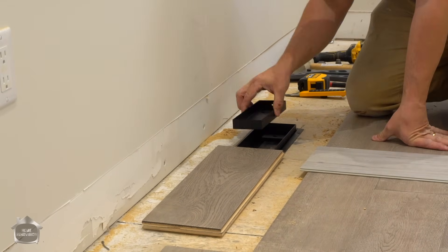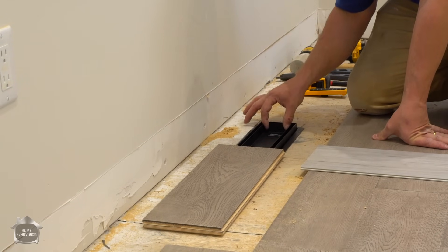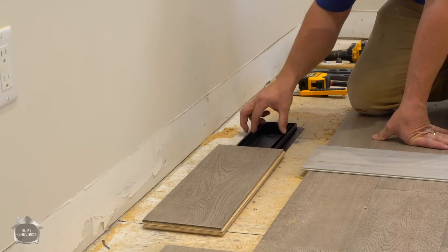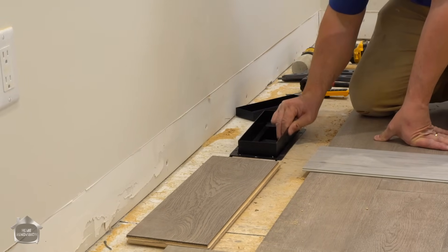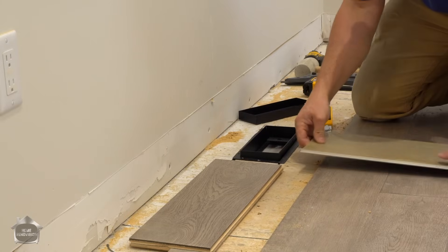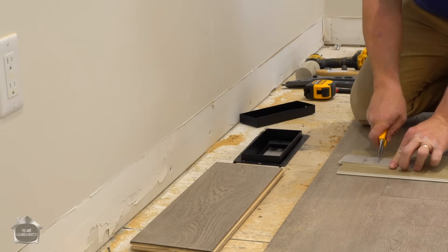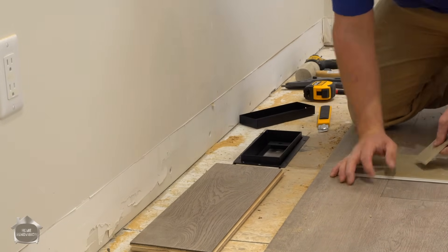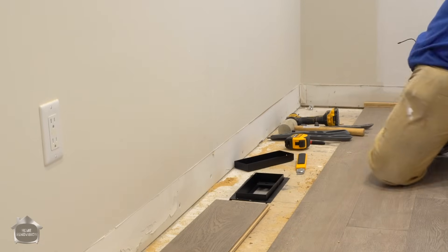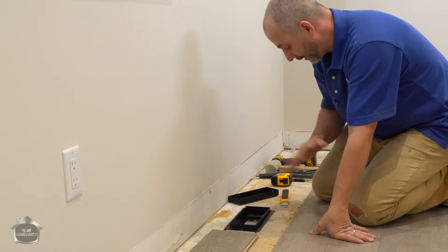The idea is to cut a piece of hardwood that fills the gap in the interior trough as well, so you end up with a beautiful little ridge all the way around that actually supplies the heat to the room. To set the height just right, I use a little bit of leftover flooring as shims — the same material used in the basement kitchenette. It scores and snaps really simply, making great shims. Once that's all done, finish cutting the rest in after cleaning up — remember our number one rule: clean, clean, and clean.